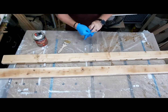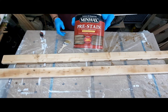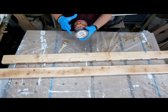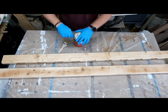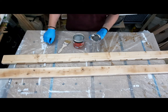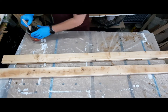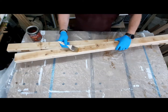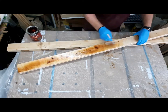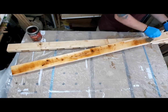Now we're going to do a little bit of prep. I like using this Minwax pre-stain treatment. Even though this wood is older, I want to give it a chance to soak up as much of the finish as I can. This conditioner treats the wood and opens up the fibers so they can absorb the finish. It's generally recommended for stain, but in my experience it works nicely for a finish coat as well.